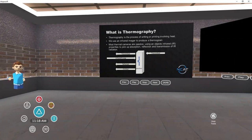So what is thermography? Basically, thermography is writing or printing with heat. Nowadays, most of it's done digitally, but that's the meaning behind thermography. Thermography has been around for quite some time. We use an infrared imager to produce a thermogram — it's a specific spectrum in the IR spectrum. They're mainly passive cameras, and essentially every object higher in temperature than absolute zero puts out some kind of IR thermal signature. The question is whether we have the ability to measure it with the tools that we have.